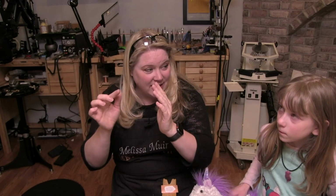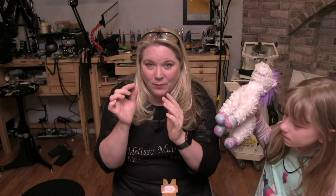As we go down that 0 line and that number gets bigger, our blade gets finer. So if it's 10/0, that means that there's 10 zeros. It's a really, really fine blade. There's lots of teeth in one inch, and it's itty bitty. Like that one, I swear those suckers break if you look at them wrong. Then on the other side, as we go to 1, 2, 3, 4, 5, all the way up to 8, again, the blade is going to get thicker and bigger, and the teeth are going to become more prominent.